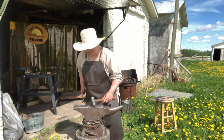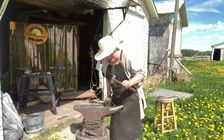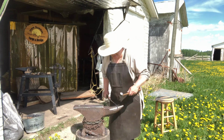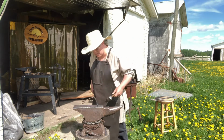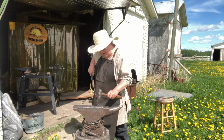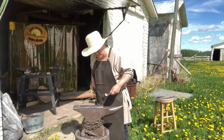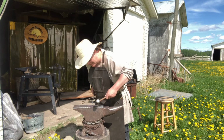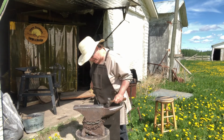So here I'm going to round it over to make a pigtail. As you're hammering here, you want to push down here, so you're getting a double effect again. And you don't want a lot, half an inch at the most, down. And you take it, turn it over 180. So this is where you really want it tight on your hip. And then you're going to be circling it and then hammering up, and moving that up towards you in a circle motion. You're going to be using all of the anvil. That smushes it forward, up against the hip again, and then down on the top.